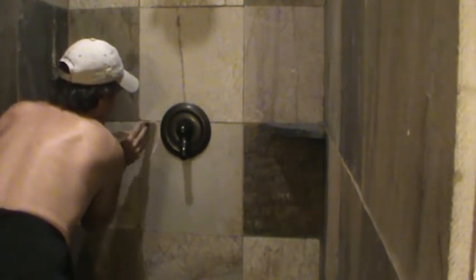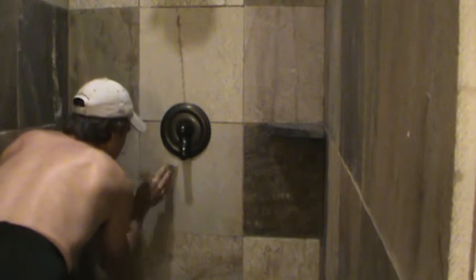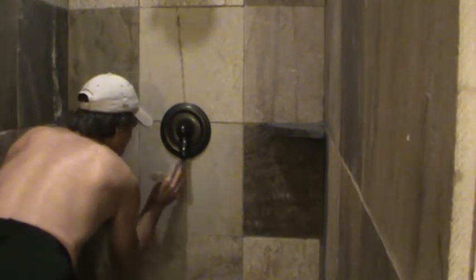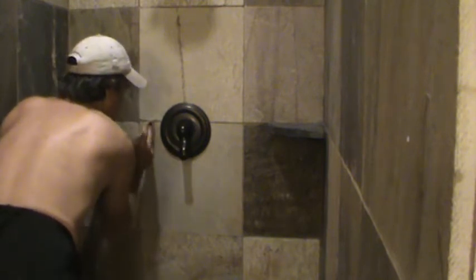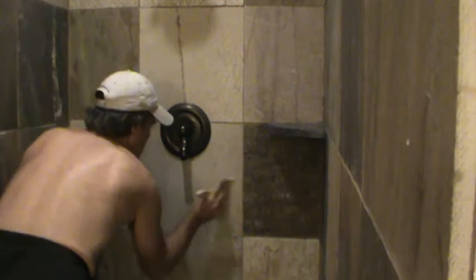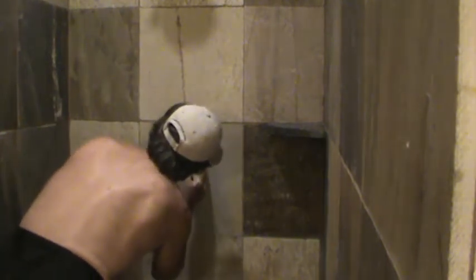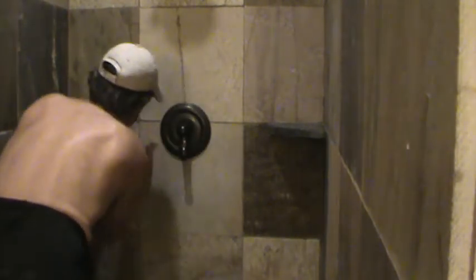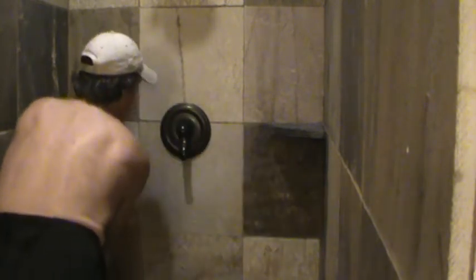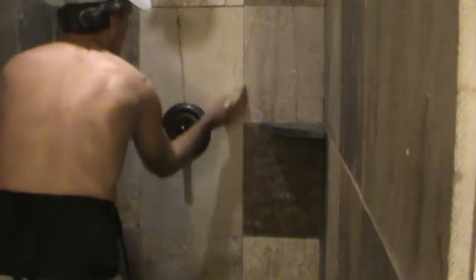Back and forth right there in the joint. Just go a little bit more if you think you need more. It's best to do that than try to build up and try to go just once, because you might get too much sealer on there at any one time and get it all over your trim, okay? Just flatten out the excess all the way around there. I'm ready for the roller there.